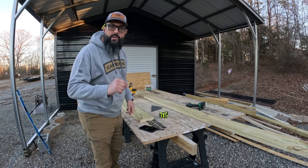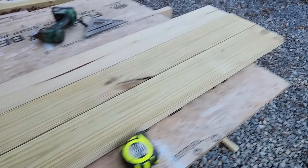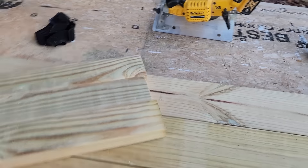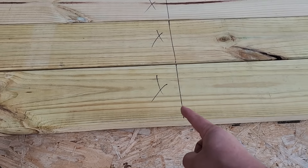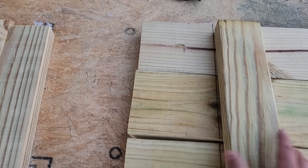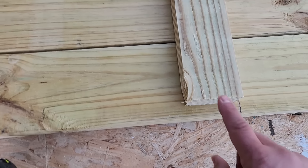I got my boards cut out — three six-foot boards from point to point at 72 inches, and three 15-inch blocks of wood cut. Six and a half inches in from the end is where that 2x4 block goes. Then 35 inches down to the next block location, and six and a half inches up from the bottom end. The X marks represent where the 2x4 is going to go. If it's off a little bit, just split the difference — not a big deal.